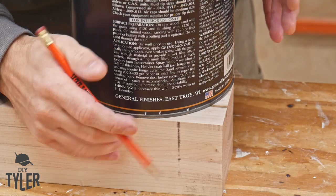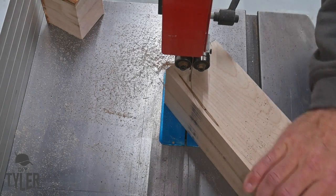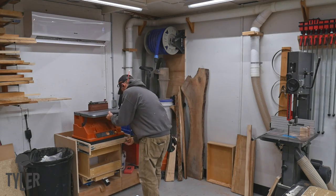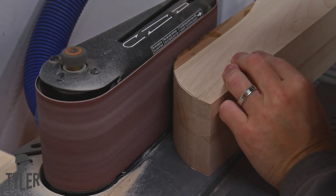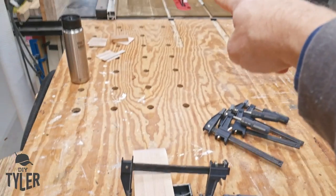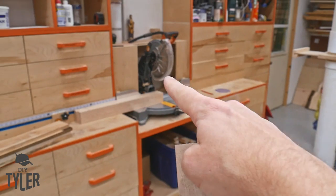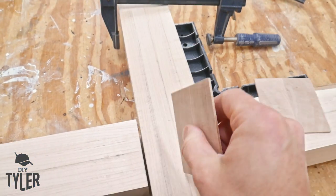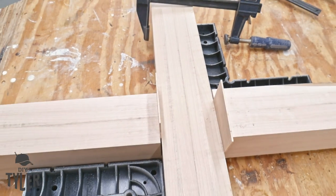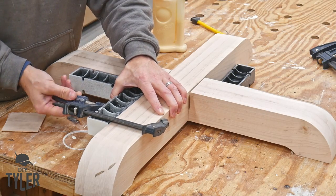Using a paint can from General Finishes as a template to mark out the curves we want on all sides of the pedestal base. We'll cut them at the bandsaw and then smooth everything out on the Ridgid belt sander — a double flip table I made a while back; plans linked in the description. Now, one of the two dados on the table saw — the first one — didn't come out so great. Using my new CMT blade on the miter saw, I was able to shave off a tiny bit and put one shim on either side to snug up that joint. Once the stain is on, hopefully no one will ever know.